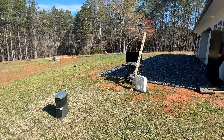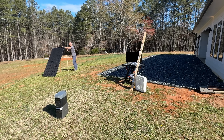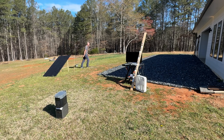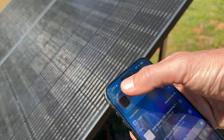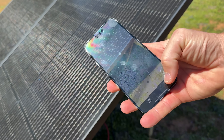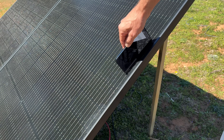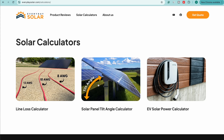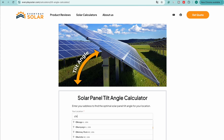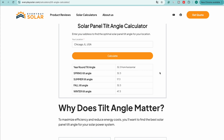Starting off, I want to bring as much solar as possible into the 500-watt solar input of the EcoFlow Delta 2. I'm going to use two 405-watt panels positioned facing due south, and for the tilt angle I'll use the measurement app on my phone with the bubble level — just place that right against the solar panel to get your angle and make adjustments. If you need a reference for your exact location, check the link in the description to get the desired tilt angle for each season of the year.